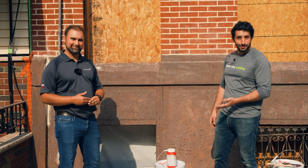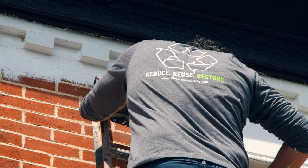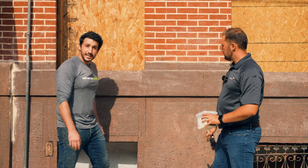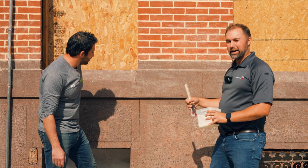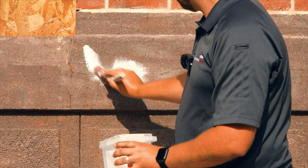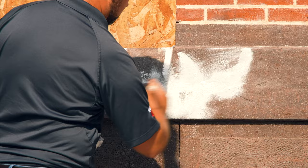So we're ready to get started. The first step on this actual project is filling in the cracks. With the Contact Plus Scrub, we have a little bit of aggregate, so instead of bridging over cracks like a Loxon XP, Sherwin-Williams, or Benjamin Moore product would do, we're actually going to fill them in here so we stay completely breathable. We're using a high-quality 3-inch brush for cutting and a couple of 9-inch acrylic rollers with half-inch nap. It really doesn't get much easier than that.